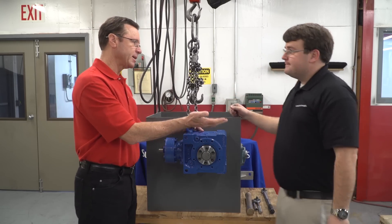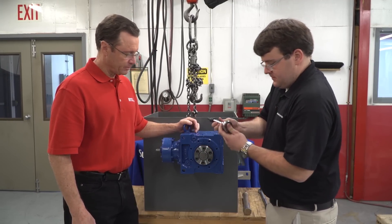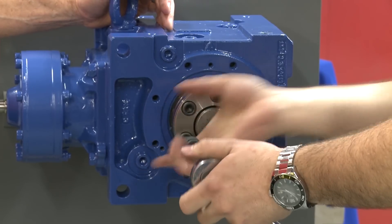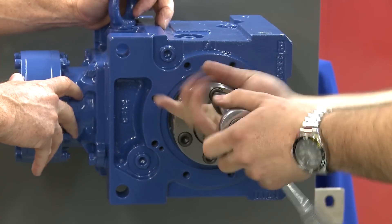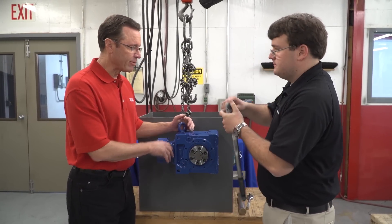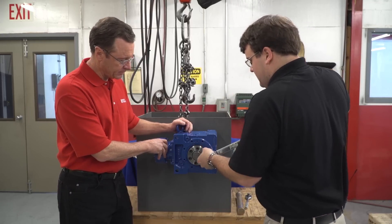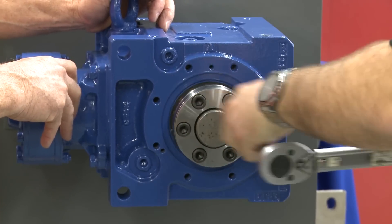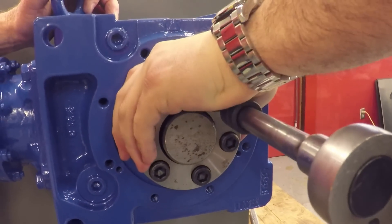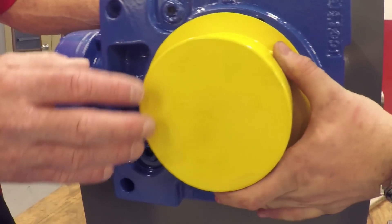We've got some more tools over there. We've got to tighten things up. So we'll take our regular ratchet wrench and tighten them up evenly in a star pattern until they stop. Once they're tight, we'll switch over to a torque wrench — always got to have a torque wrench. Set to the correct torque level for your size unit, and we'll go around in the same star pattern, torquing them all the way around. This is usually the last step. Once we're done here, we're good and we're installed. The only other item we'll need to install, once it's installed completely on the shaft, is our safety cover.